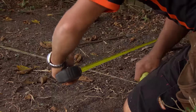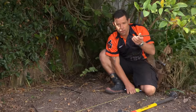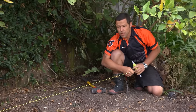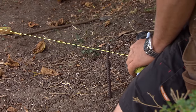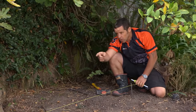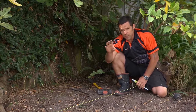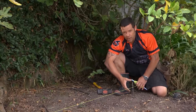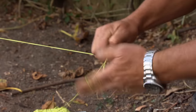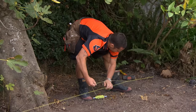I've run my string line out and I'm just going to come 1.4 meters. We're just going to use our little reinforcing rod here. Because my backyard is sloping downhill slightly, I'm going to ensure that my sleepers are actually parallel with the ground. I'm going to measure up on either end of this reinforcing rod about 110 millimeters, because our sleepers are around about 100 to 110 mil. So that way the top of my string line is going to be the top of our sleepers. Let's just make sure we get our string line nice and tight — we don't want any sags in it.